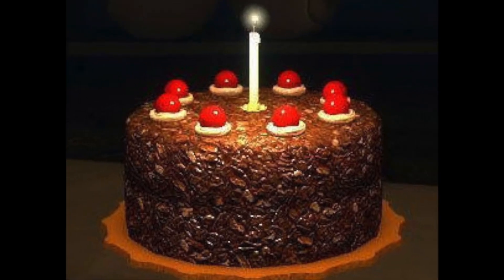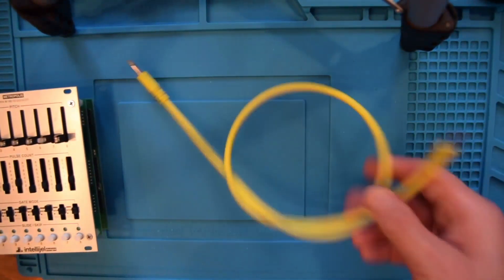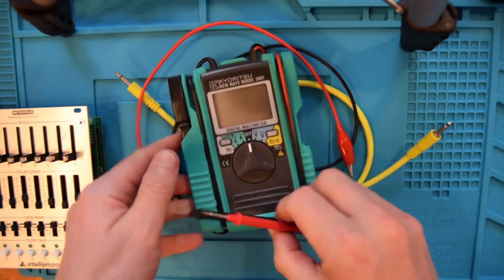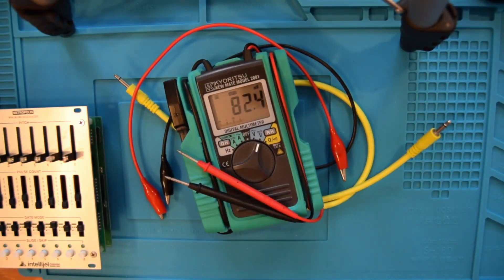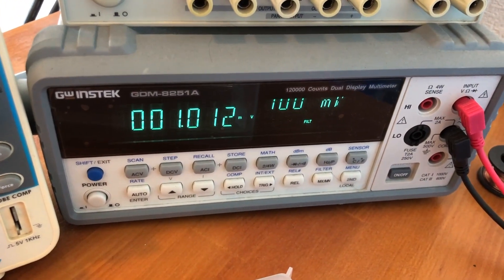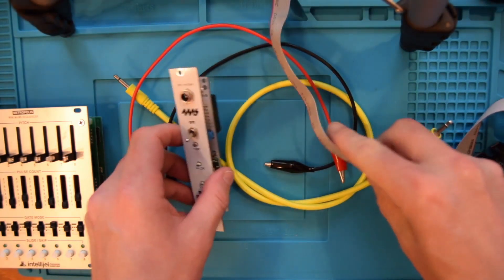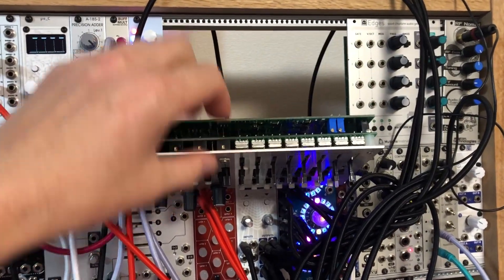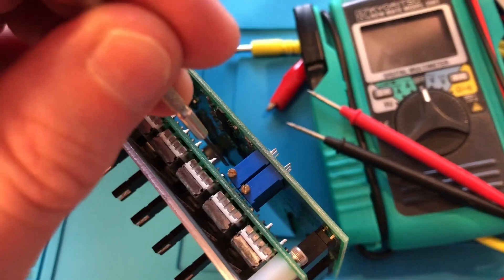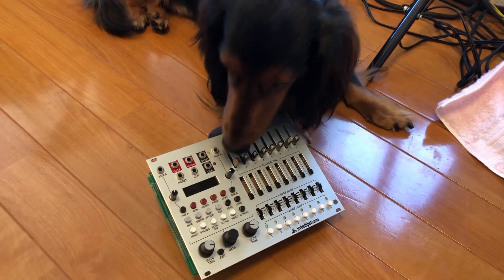However, this is really easy. If you follow a couple simple precautions while dealing with electronics, you'll be fine. First, you need a couple simple tools: a reasonably long patch cable — anything about 30 centimeters is probably fine, but not too long; a voltmeter of some kind, preferably with three or more decimal places of accuracy — handheld models will work fine, but we'll use bench equipment for this example; two alligator clip leads, or your preferred way to connect the voltmeter to your patch cable; power to the Metropolis module — this can be done with the module half hanging out of your rack, but it's much easier and safer if you can place it down during calibration; a little tiny flathead screwdriver for adjusting the trim pots; optionally, an anti-static mat to work on, but making sure you're grounded to the module at all times should be enough. And a puppy to keep you company.